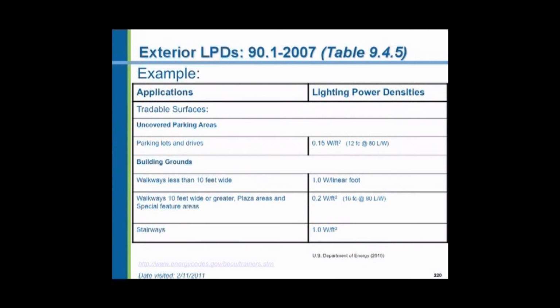Well, that's not uniform distribution. With a single source lamp, the light is distributed mostly underneath it. And they try to shape the reflectors to push the light outwards. And they give you some diagrams of how the light displays on the ground. And you reach a minimum lighting level. For typical use in a parking lot, it's half a foot candle. And that's the light of a full moon at night.